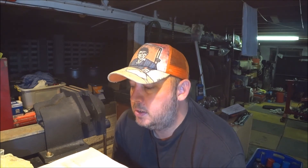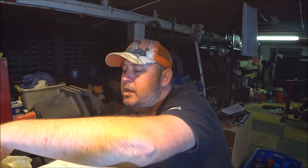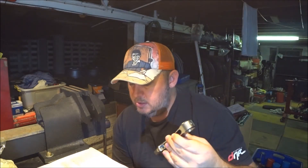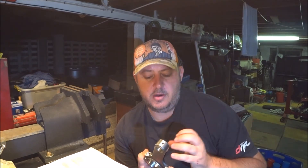I'm going to do a quick look in the forums - lots of people use these spool rods - just about the oil hole. See what I can find, see if anyone's asked that question before. Find out if there's any ups or downsides to not running that oil hole at all. There's no oil hole whatsoever. There's sort of nothing to relieve the oil from within the bearing at all, apart from it making its way outside - which might be a good thing, might be a bad thing. It might be easier to make them slightly less round and have a hole so you don't have a pressure surge inside it when it's running on the oil film.